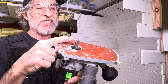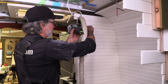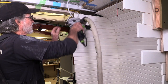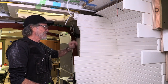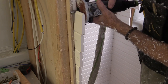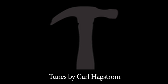This is a router with a flush-cutting bit — it's a Festool MFK and it has an extended base. But you can put an extended base on any router. It's going to help me hold this thing flat against the PVC as I run the router bit, and the bearing right here rides on my half-inch Baltic birch wall. It's a dirty job, but somebody's got to do it — may as well be me. Let me show you how this bit rides on this wood back here.